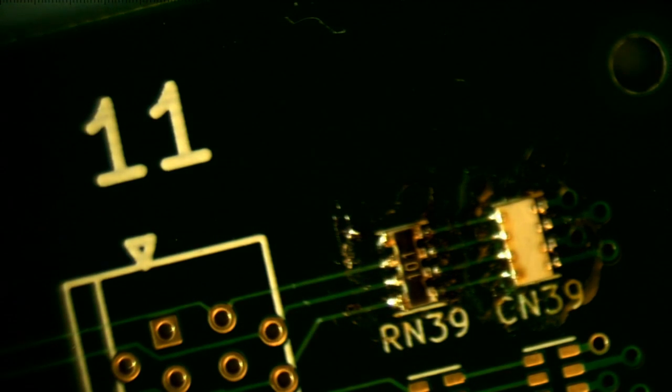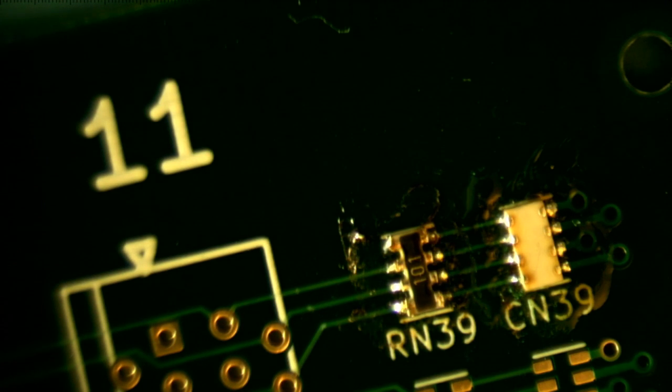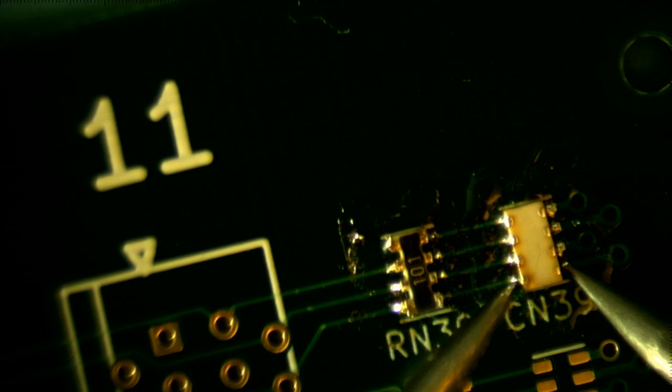Okay, and just running along. Okay, I think that may have done it. So, okay, let me grab my capacitance meter now. And see what I'm getting. So, capacitance. All right, so between ground and this point, I am getting 0.5 nanofarads, or 500 picofarads.